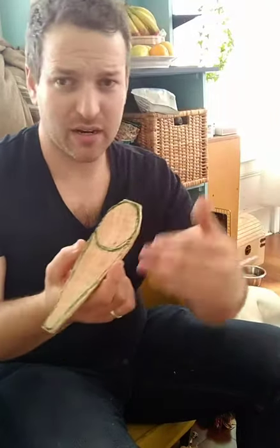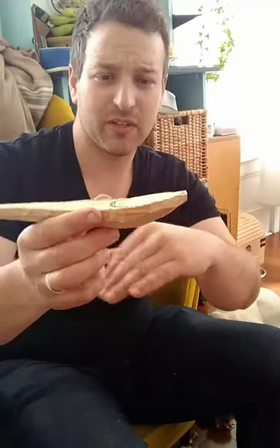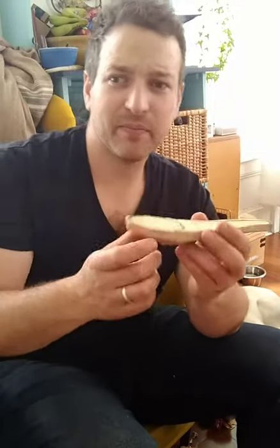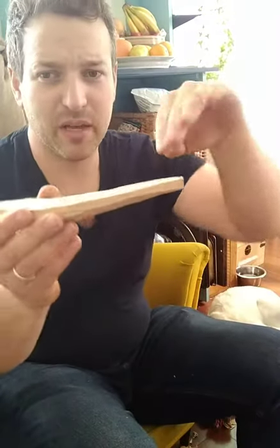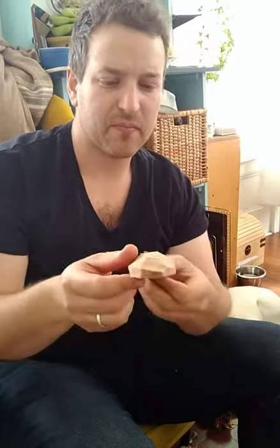And of course, all of this is done on a piece of wood that already has the crank carved into it. And then you see that I've left myself enough room in this rim to be able to exaggerate that crank a little bit further if I want to. And also I've left enough room here to be able to put a swoop the other way in the handle, so that everything is sort of swooping down into the middle. And then on the back, I've just established a middle facet and then facets on either side. And on mine, I just tend to like the feel of having three facets running down the back of the handle. And then I'll do the bowl different ways depending.